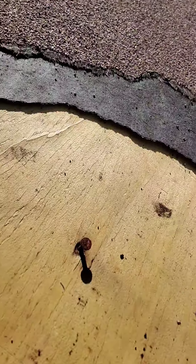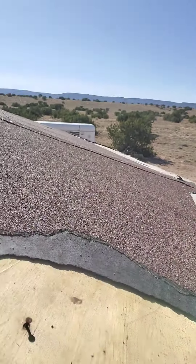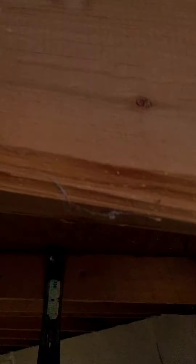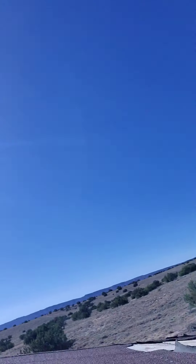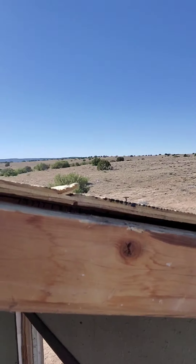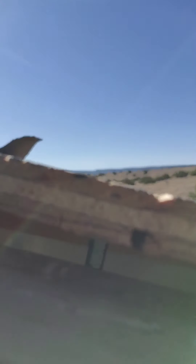The best thing to do is knock it up nail by nail and target it nail by nail. Go here, rip that one out, get underneath with that pry bar, lift right here, spot those nails from under there, and then lift it up.